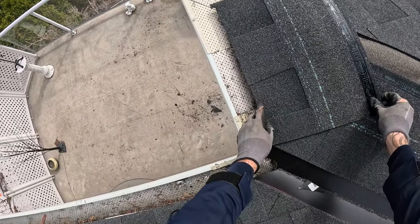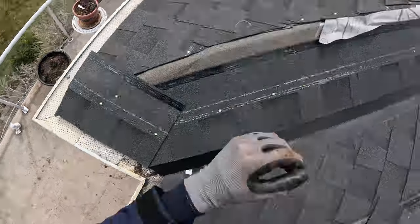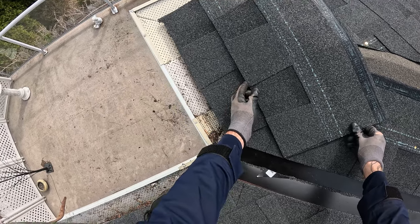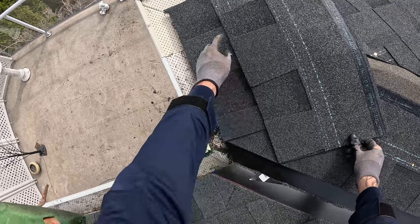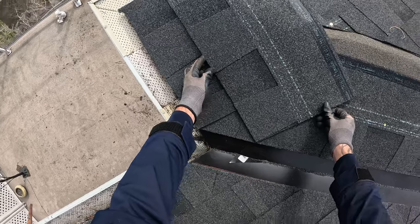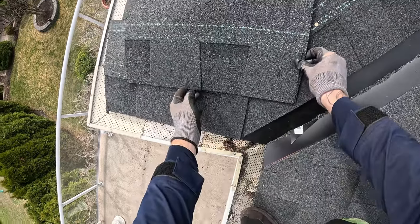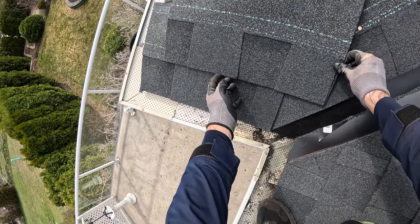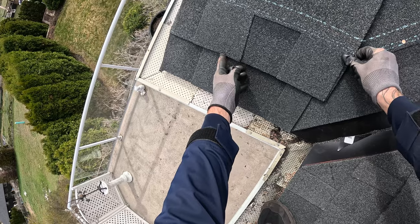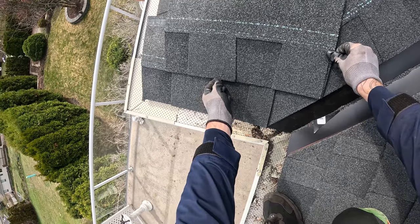These shingles again — they're short, very annoying. You can start running up; you can use your eave for the first little bit. When they don't sit it just makes it annoying. That's why I'm teaching you this trick — so if your shingles do start twisting, you have a reference. When the shingles aren't cut square you get these huge gaps. Let's see if I can fix this.